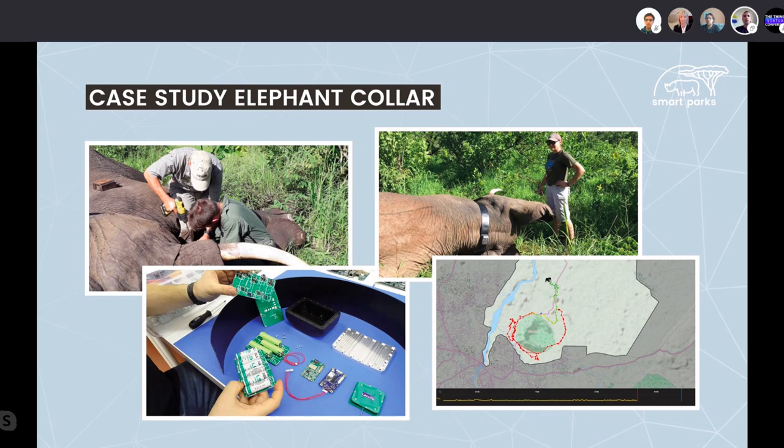So we try to break all of these rules, let's say, and make it very lightweight, and therefore it needs to be low power and connected to the LoRaWAN network we already have. Currently, you can actually see the tracks of this first open collar elephant tracker deployed on an elephant in Malawi. It generates a GPS fix every 15 minutes and sends it over LoRaWAN. And it can last for 8 years or even more,